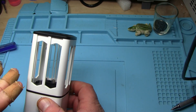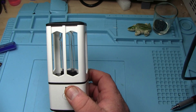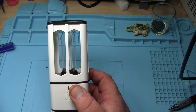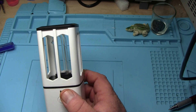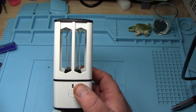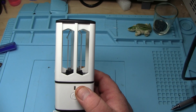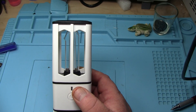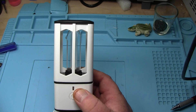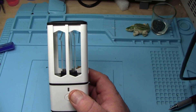I was doing some reading — remember how it said it puts out two different wavelengths of light? Well, the quartz tube blocks the 185 nanometers and outputs the 253.7 nanometer wavelength. The pale blue light is due to the spectral lines from the mercury also contained in here. These bulbs are only about 30 to 40 percent efficient, but they do what they're supposed to do. It's going to cover a small area — the further away you get, the less you're going to get, multiplied by the law of inverse squares.